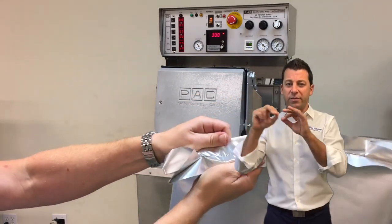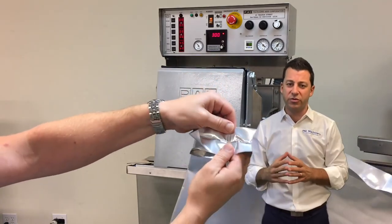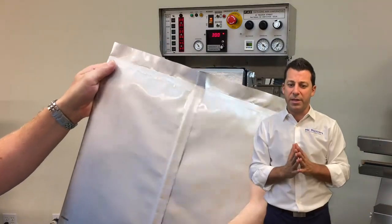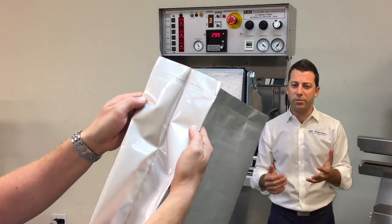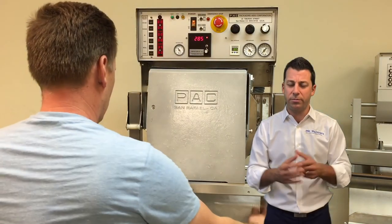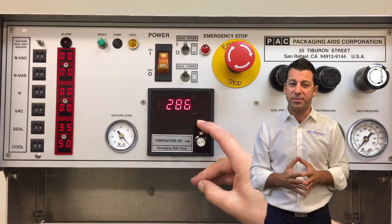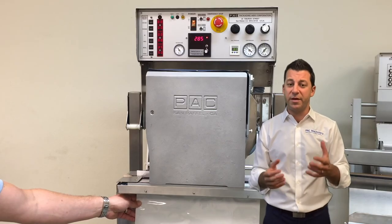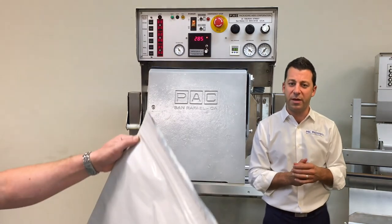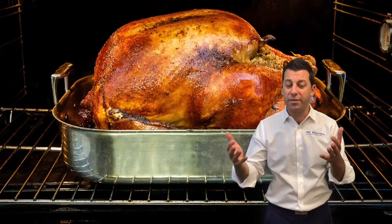At the end of the cycle, you can also have a cooling temperature — so the seal bar opens at a certain temperature, or you have cooling time where the seal bars are still closed and then open at the end of the cooling time. This is especially important with materials like polyethylene, which require cooling under pressure. With temperature control, you can actually seal for a much longer period of time since you're maintaining a steady temperature throughout the sealing process. Think of turkey on Thanksgiving.